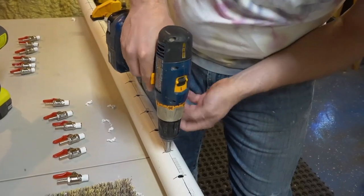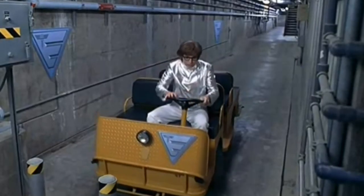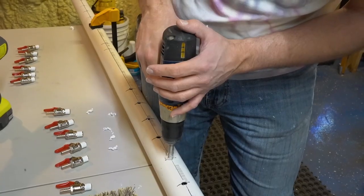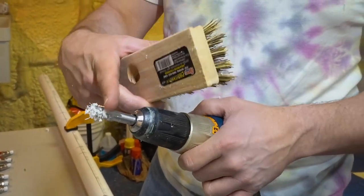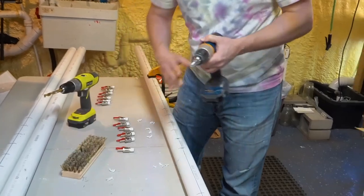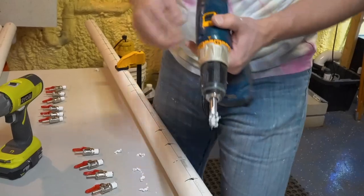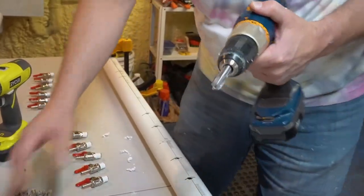Go in nice and straight, about three quarters of the way, then reverse it. Don't put any pressure on those threads — it's nice and gentle. Pull it out and clean it off. This is plastic, so you could strip it pretty easily. That stuff you clean off, you don't want it affecting how well the next threads come out. It's a bit of a pain but that way you get a tight fit. The last thing you want is to get the whole warehouse plumbed and then have leaks and have to replace a whole bunch of pipe.